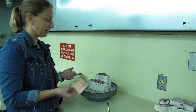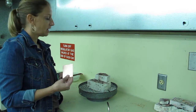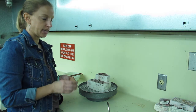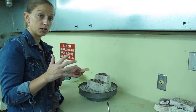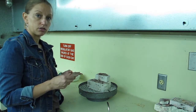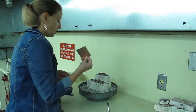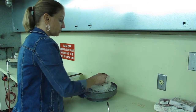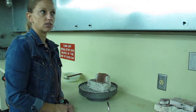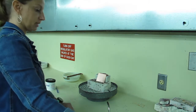The next process we need to do is called annealing. We're going to be annealing a lot for most of the time that we're doing things. I'm going to show two different ways to anneal, because annealing is the process of getting the metal to a prescribed temperature to reform the crystalline structure and make the metal usable. This is copper — it's our softest metal and it takes on patinas and pattern really well.